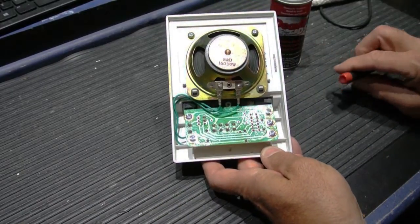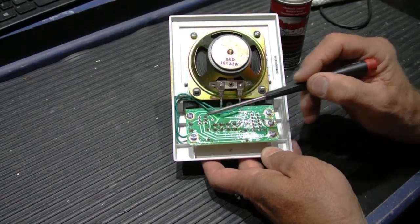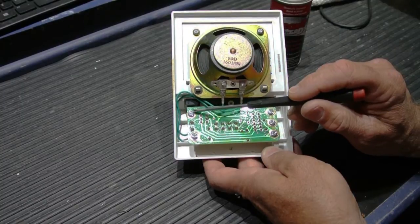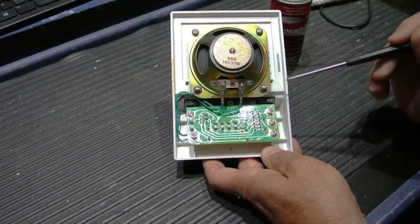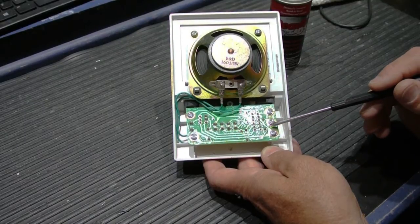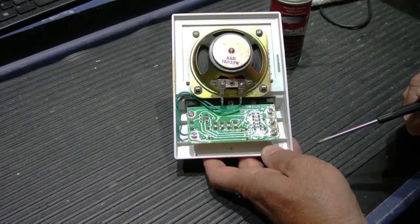The back of the station is very simple. You have one standard NuTone 3.5-inch speaker cone attached to the back of the grill, and you have one circuit board with the switches all on the opposite side. On all N485 speakers, there are 5 wires attached to the speaker: control, ground, audio 2, audio 1, and ring. The control, ground, audio 1, and audio 2 are common wires that run throughout the entire building and the entire system. Everyone that has one of these speakers in their apartment uses the same control, ground, audio 1, and audio 2 wires. They're common throughout the building.